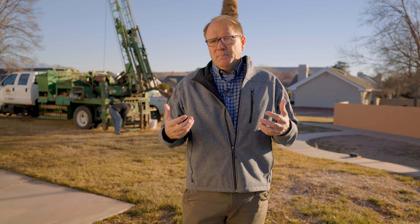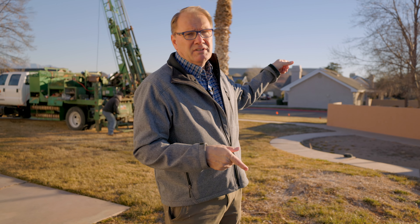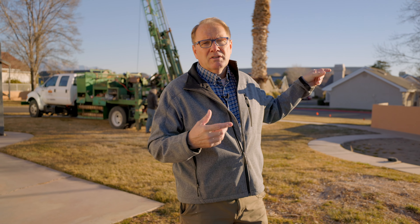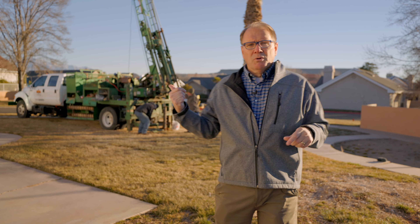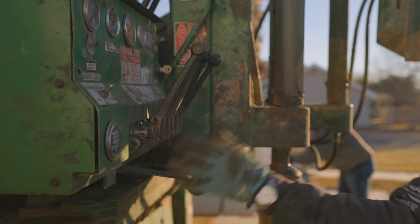Here, I'm on expandable clay — blue clay soil. Down the street it's really nasty. A couple of homes had to be demolished and rebuilt with better engineering to accommodate for the expansive soils. So we've got a drill rig here and we're going down 20 feet to see what the strata is.